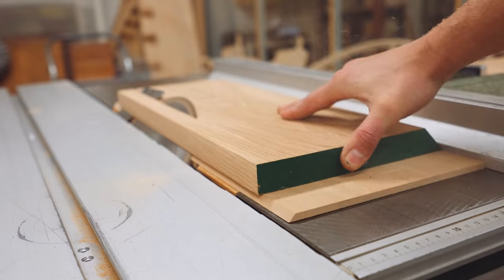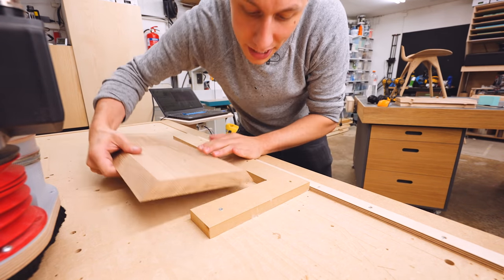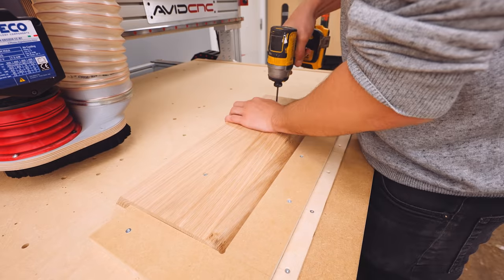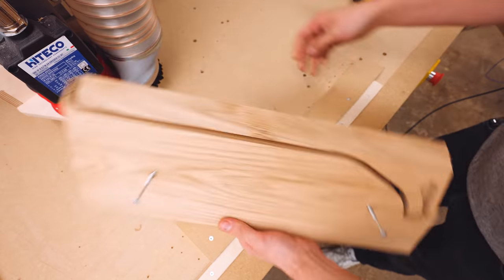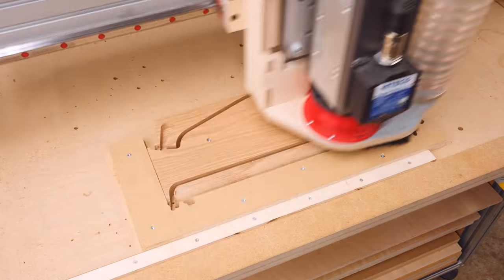So my plan is to attach this board onto this little jig I made here on the CNC machine. I'll then cut out a leg, flip this whole thing 180 degrees, and cut the other leg out of the other side of the board. That's why both sides are chamfered. And if you repeat that process three more times, you end up with eight of these leg pieces,